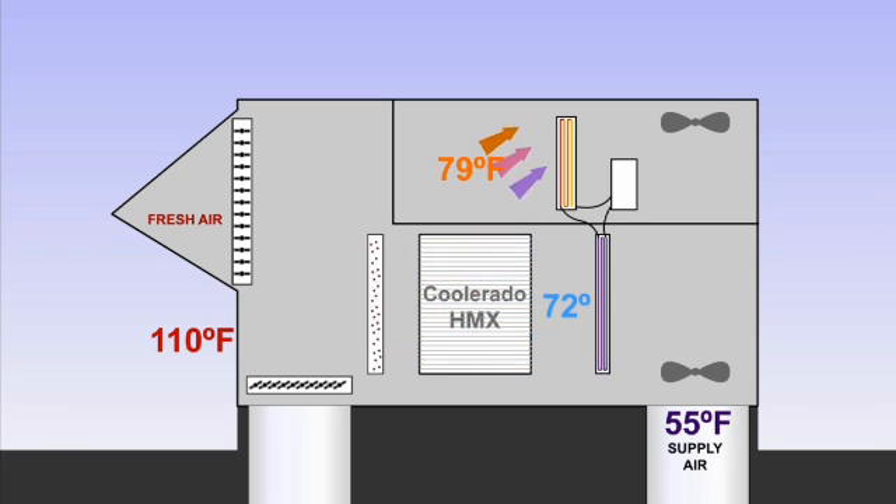At 79 degrees, the working air example is over 30 degrees cooler than the 110-degree ambient air. The saturated and cool working air is used to remove heat from the hot refrigerant condenser coils more efficiently. The working air leaves the hot coils at 97 degrees, and then goes on to cool the two-stage refrigerant compressor and working air fan, saving even more power.